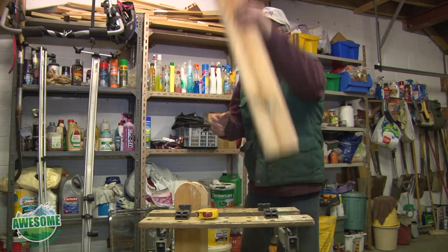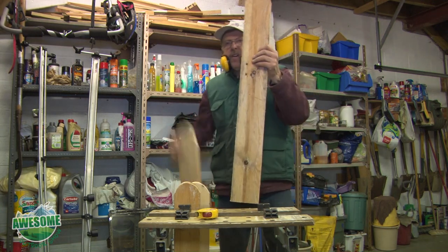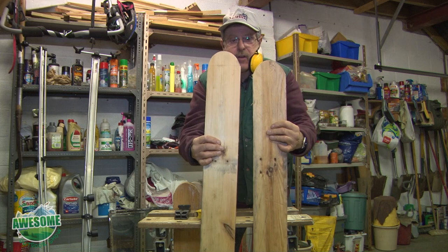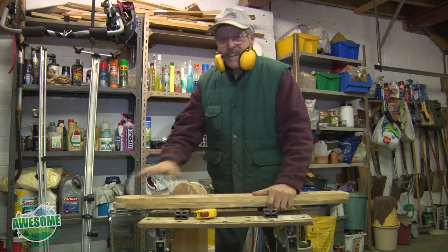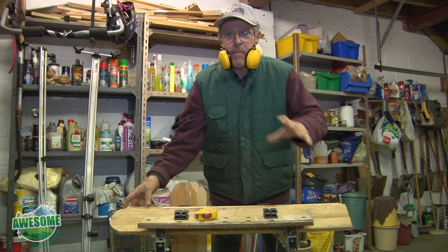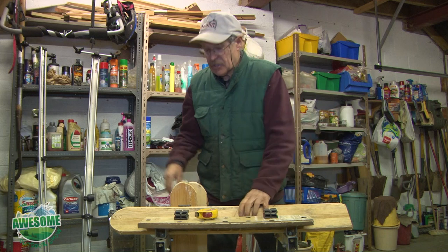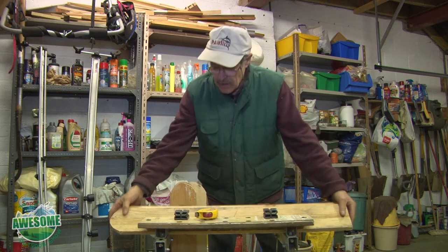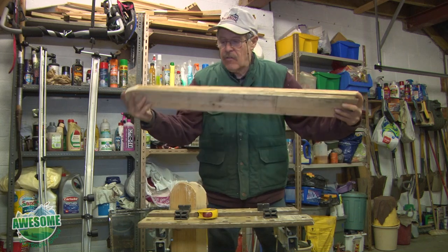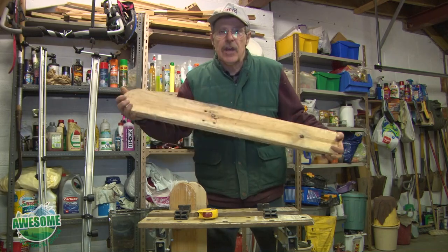There we go. That is the actual picket fence panels. They're going to go like this, all cut. I've got four there, measured up. Just sand them down and then make sure that you fit them equidistant between the two uprights. And I'm going to nail these in because the main structure is screwed and glued, and nails then bent over, I feel, is fine for doing the rest of the panels. Let's get it together.